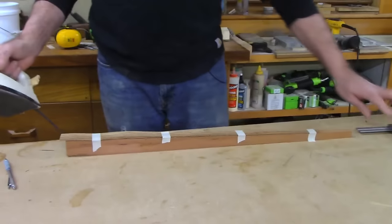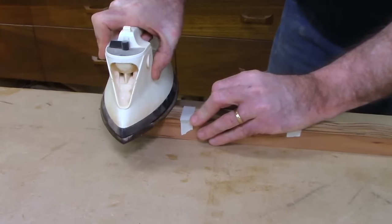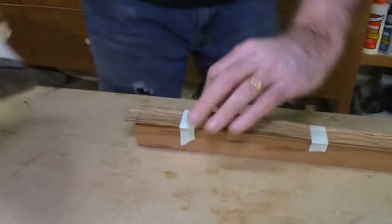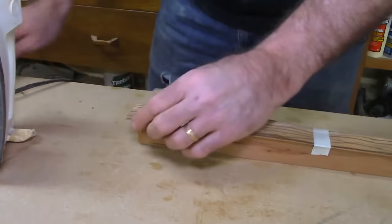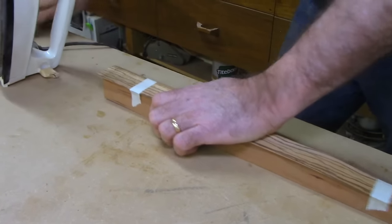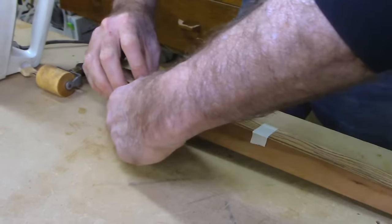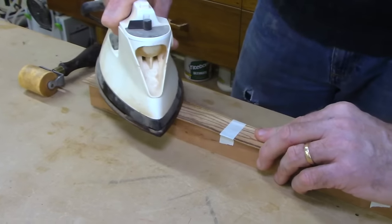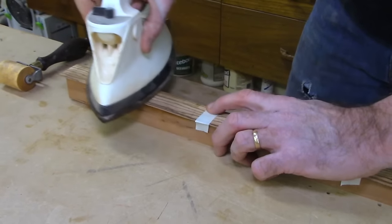Alright, this is good and hot. Let's give it a shot — we're going to start up here and tack it down. It's going to be like liquefying or plasticizing the glue, and I'm just going to bear down to the edges. I like getting my roller out. Can I throw some questions at you while you're doing that? How about hide glue for veneering? Hide glue works great — we did a curved drawer front with it. It's tricky though because as it cools it grabs, so you need to have everything warm. It's hard to use in the winter.